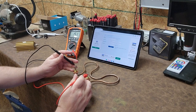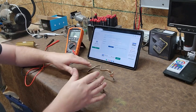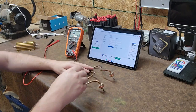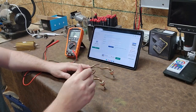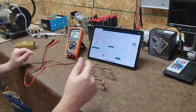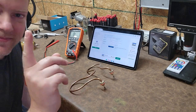That reads 15.2 ohms. That's a quick one just to show you how to use Ohm's law to determine whether your heating element is good. I could have saved somebody a lot of money here — this was misdiagnosed, just like a lot of other parts are in our industry. That's why I'm here: to encourage you to please do a better job. Thanks for watching.